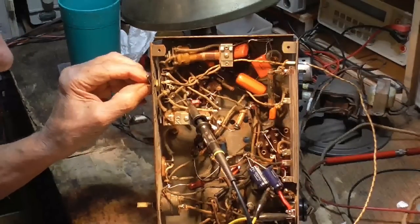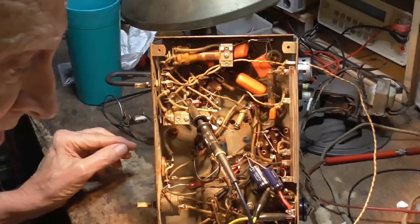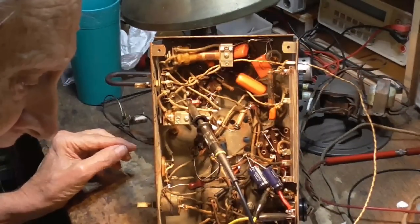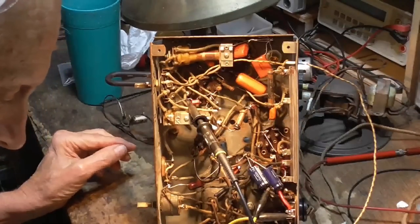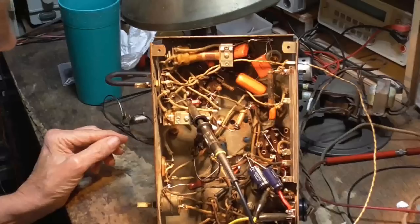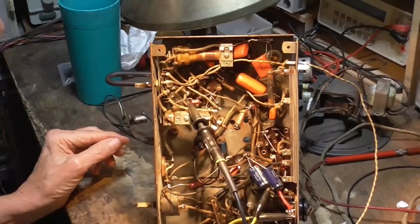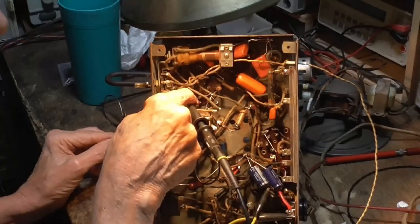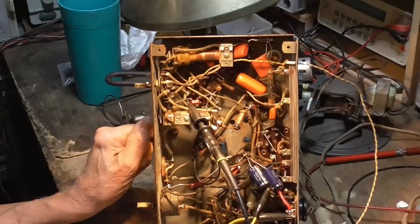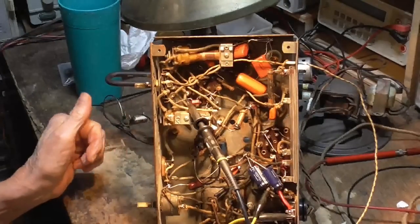We still don't get any oscillation on the short wave. The lowest frequency we get is 927, and 465. That calculates out to 462. It could be that the scope itself is loading it. Let's see what we go up to. All the way up.